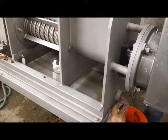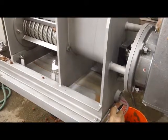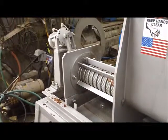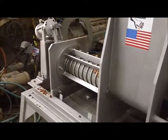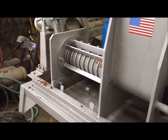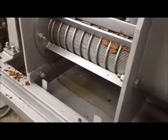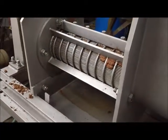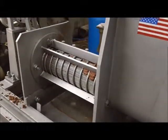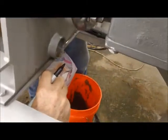We're going to run the screw in reverse for a few revolutions. Alright, now we're going forward again — that should increase the amount of liquid coming out through the screen. I am getting a lot heavier flow. I think that maybe a screen change or the auto-reversing would help, but I doubt you'd need both. Yeah, this is a lot better.